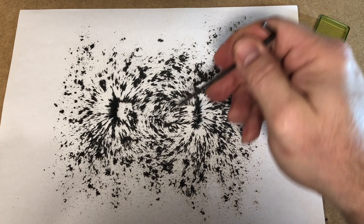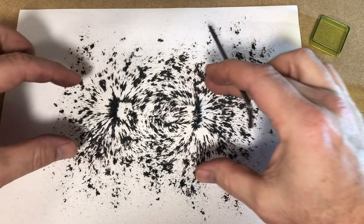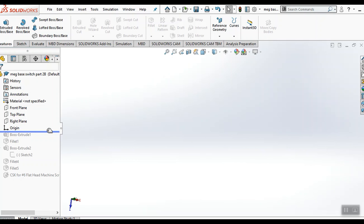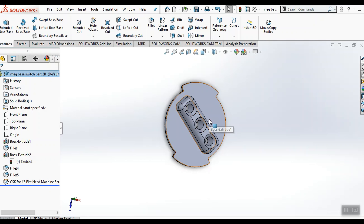How does it work? Let's discover the magic inside the box. Most people think there's a barrel in here — magnet positive/negative — so when it turns on it works and when it doesn't it doesn't. That's not quite how it is. This is actually three pieces of metal. If we shine a light in here, you can see clearly how those are separate pieces of metal. This here is also another piece of metal, and you can see the lines going along here. My regular magnets are not strong enough to depict it, but these super magnets here are very strong. This centerpiece is aluminum, and this side is steel, and this side is steel.